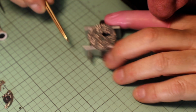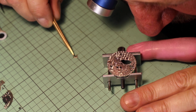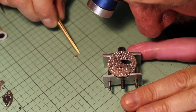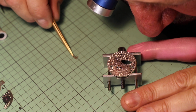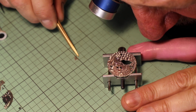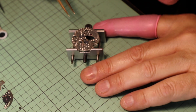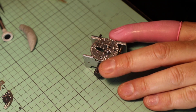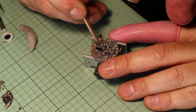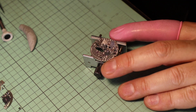And here's our set lever, which has a lot of functions. Its own pivoting and depression button. This is your hack pin. This is the pin that engages the stem, and this is the pin that engages the action. Set him with the group. And now we have a rocker. And see this groove right here? That's how your set lever goes from position 1, 2, 3, or 3, 2, 1.